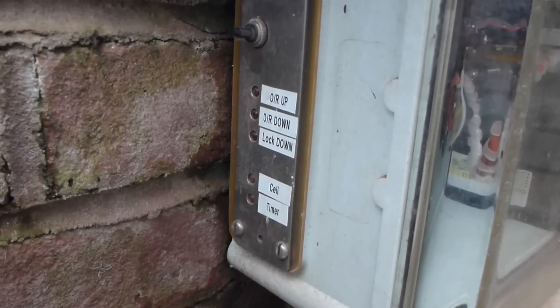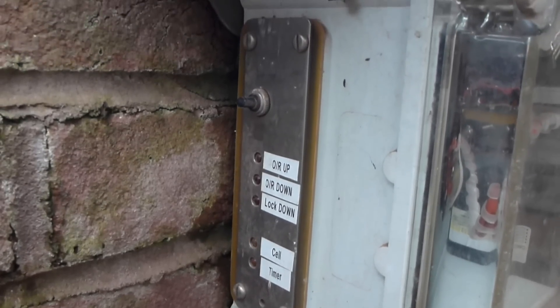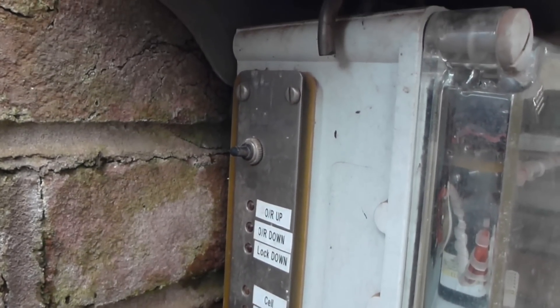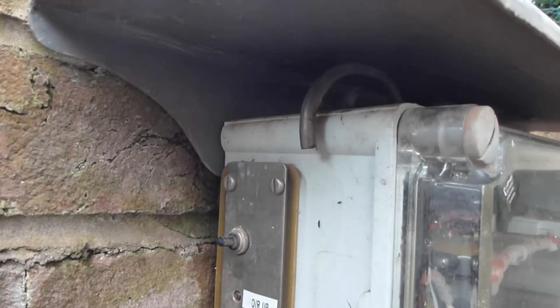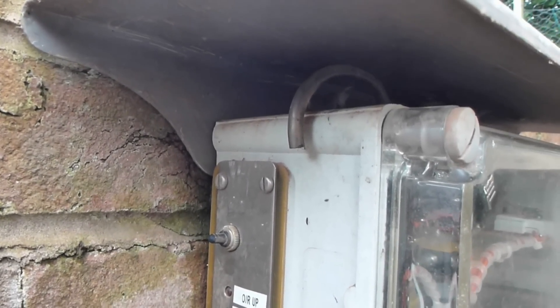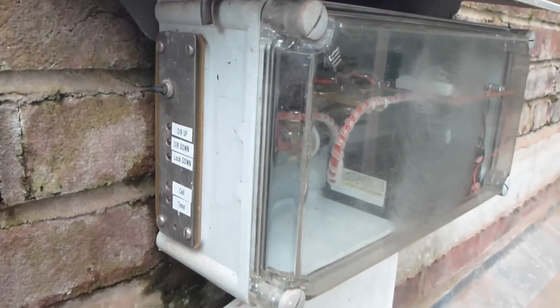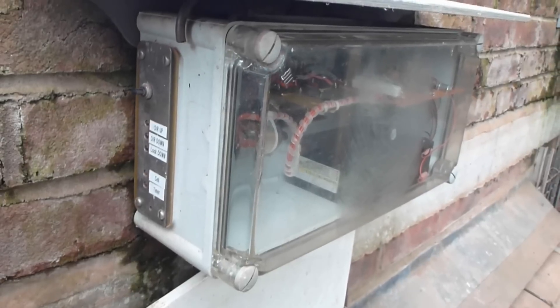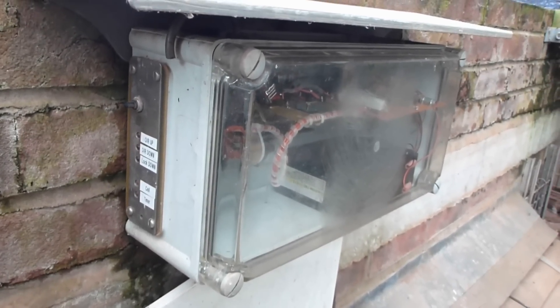These are the controls. The LEDs indicate the mode, which is selected with this little toggle switch that can be flicked up and down. Incidentally, up at the top there is a small vent — that's fitted because in any sealed box where there's a rechargeable battery there's a chance it would produce hydrogen, and it would only take one spark from the motor for disastrous consequences.